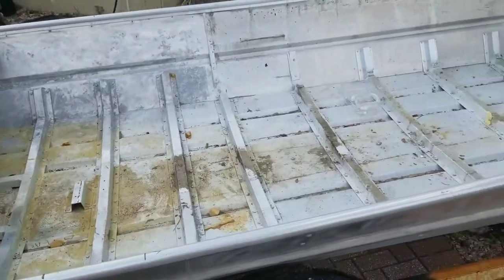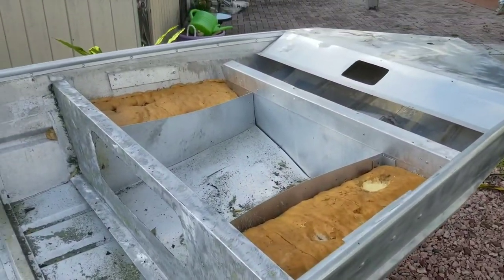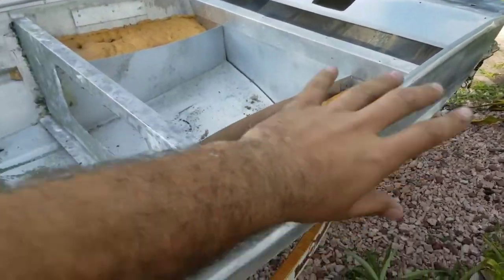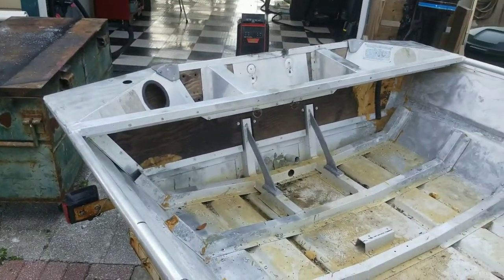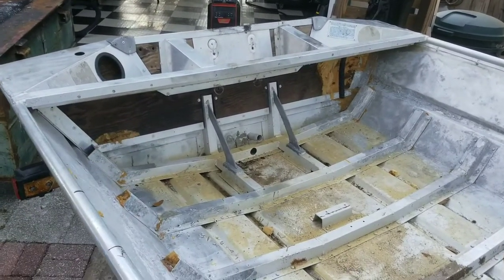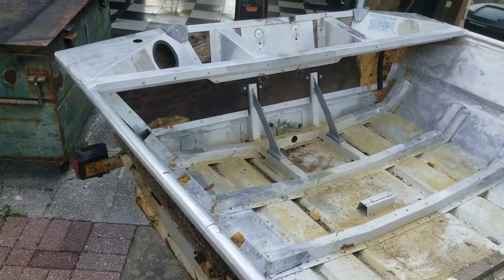This is how far we got last night — got the thing completely gutted out for what I want to do with the front deck. I'm just going to leave it the way it is and work off of that. I might change up the front part a little bit more, but that's what we're working with right now. This whole transom is coming out. The wood's in really good shape but I want to do something different — I'm going to pull out the old wood and do an all-aluminum transom.